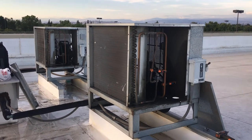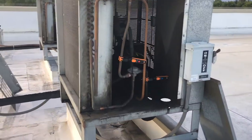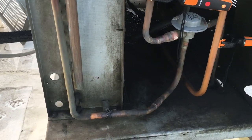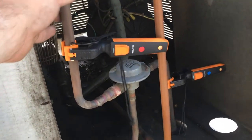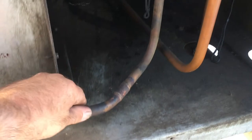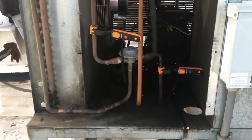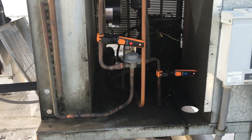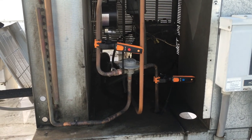Just to show you guys the comparison, I gauged up to the unit right next to it. This is the unit that I filmed a video of — I fixed the leak on it, there's a little rub-out down there. Anyhow, this line is really hot, okay? My condenser line is nice and cool, and with this other line, nice and cool too. So there's a good picture of a headmaster. I also took a picture of what the test gauges look like hooked up just to show you a comparison of those pressures.